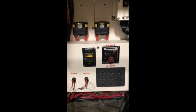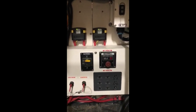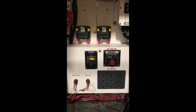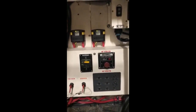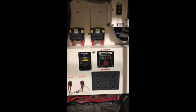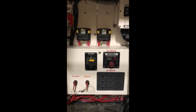In this particular situation, on the boat we're on, he has power to this boat all winter long, and he has automatic chargers. The best case scenario for these is we leave the batteries turned on and leave the battery chargers turned on, and basically these chargers will kick on as needed to keep the batteries as fresh as possible.